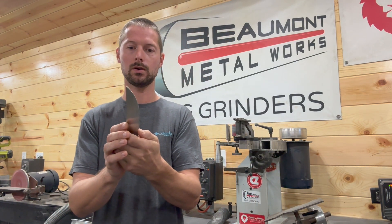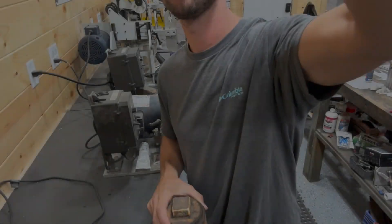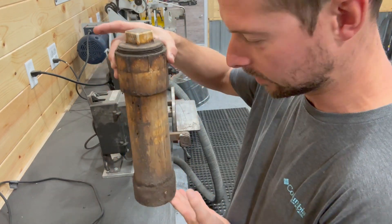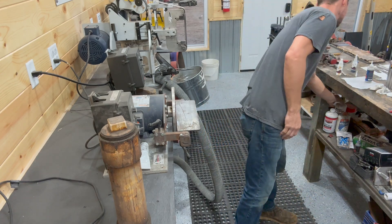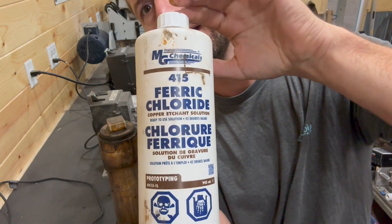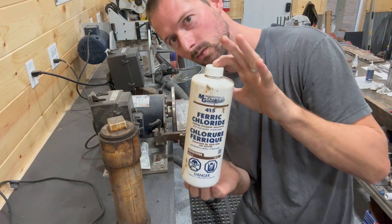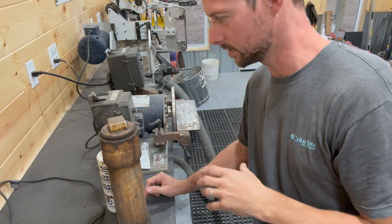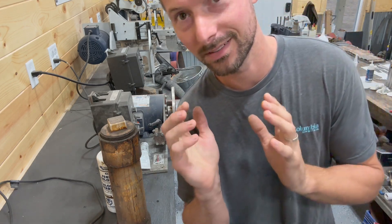I'm going to show you what chemical I'm going to use to clean and to get this etch started. I made up a bunch of these little PVC tubes with a cap to keep my different chemicals that I use for etching. This one is ferric chloride — I'll put a link below to this, you can get it on Amazon — and this is mixed 50/50 with apple cider vinegar. That seems to be the best combination I've found to get a really good consistent etch. Mix them up, make sure your container is big enough to put your knife in, and then let's get the knife prepped to get in the soak.